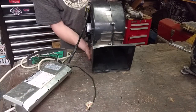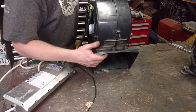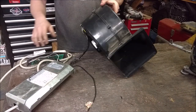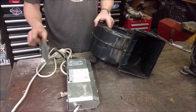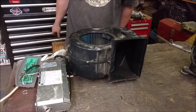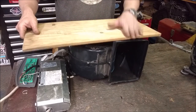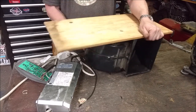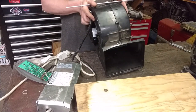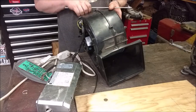One of the shortcomings of the other one is I put adjustable feet down here so you can kind of direct it, but you can't really direct it. I end up always just propping it up if I need to dry out a floor surface or point it up to dry something. I want to make it more adjustable. I want to mount all the electronics and have this control panel on top. I was going to weld up a frame, but figured wood is perfect for this. I'm going to build a frame on each side and use all-thread to suspend the fan in between so you can cinch it down but also position it up and down.